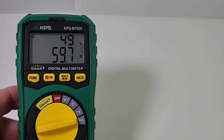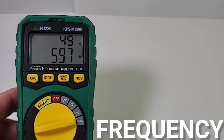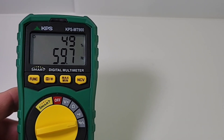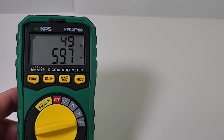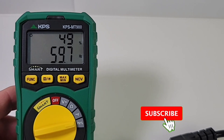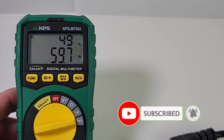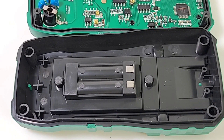Finally, frequency mode — it's a very weird range: 60 Hz to 3 kHz, but also 50% duty cycle. Under 60 Hz here, plugged into the standard outlet — looking good. A nice feature to have: duty cycle as well as frequency all in one fell swoop. Very nice.